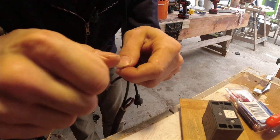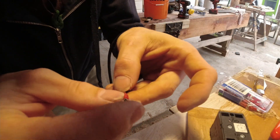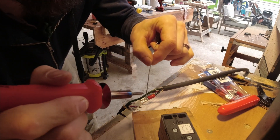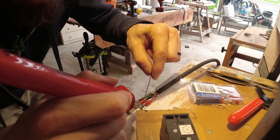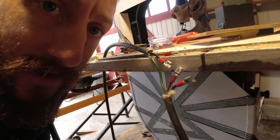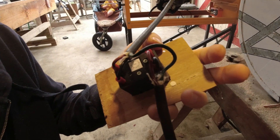So we're going to twist this and we're going to twist this. The next step is kind of unnecessary probably, but I'm just going to actually solder this on. So we've got our connectors all put on here and now we'll just put them in there and test it out and see if it works. Hopefully we've got an updated bandsaw with an NVR. We've got the red and the black going in, the red and black going out, making sure that the colors are on the same side.